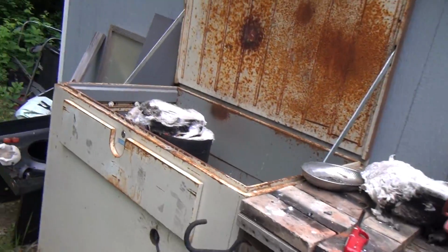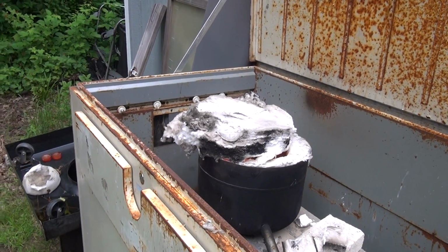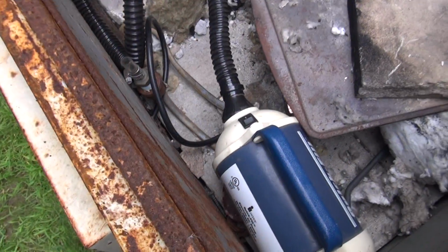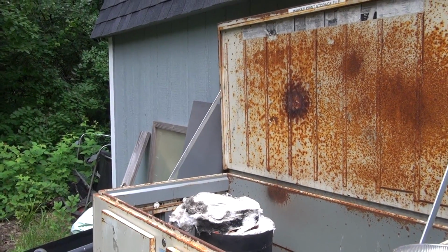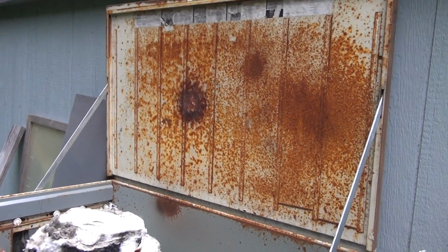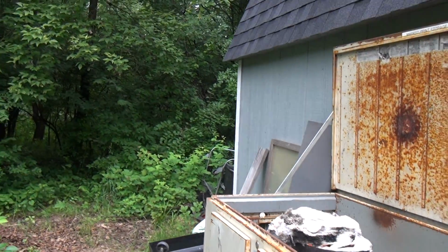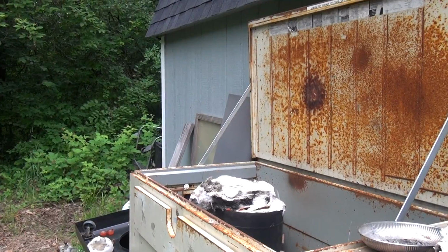I've decided to give my furnace another try. As you can see, I've got it heated up red hot. I used a different pump. The pump I used before was for inflating toys, you know, for floats in the pool. This is too, but it's bigger. It's delivering more air and it's getting much hotter. So that was my main problem with heat, I wasn't giving it enough air.